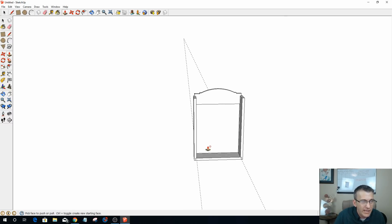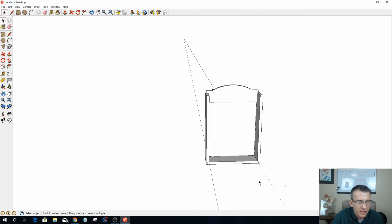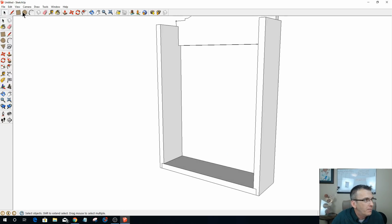All right. Now, once I have all these parts drawn, I can actually import them into the Vectric software, which you'll get to see here in just a second. I want to just go ahead and lay out the shelves and everything. Now, mind you, my bottles are going to be 1 3/4. Oh gosh, what's the math on that? 1 3/4 divided by 2. 1.75 divided by 2 is 7/8, I believe. 0.875. Okay. And those bottles are, like I said, standing roughly around 4 3/8.